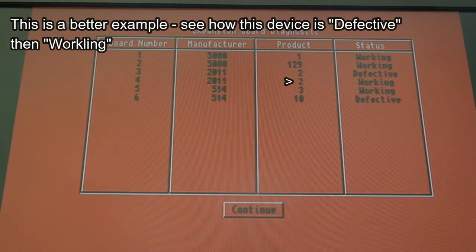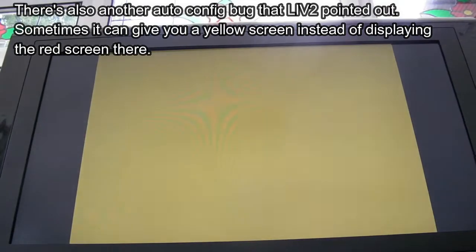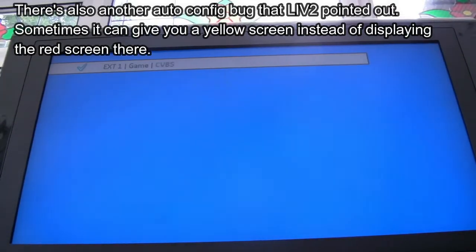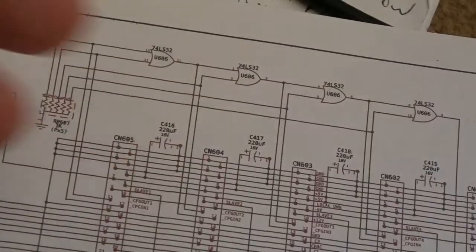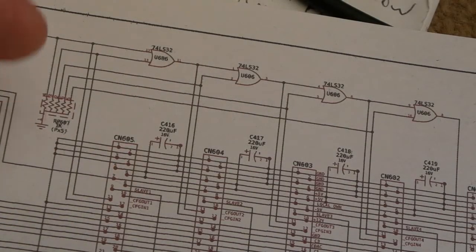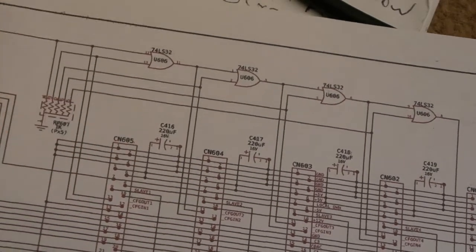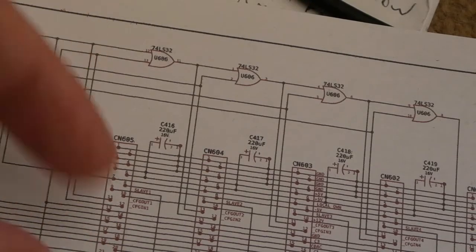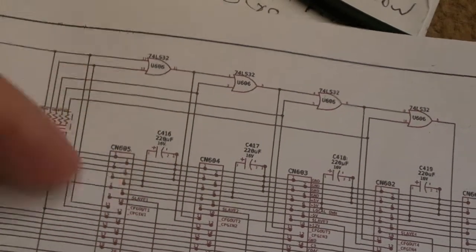With Kickstart 3.1, sometimes the order that you've got cards in these slots matters, as it goes and tries to check the size of each card and whether it can accommodate. So you've got a RAM board, one's 4 meg, and then you've got another 4 meg and another 4 meg. You can't possibly map all those in. The Zorro 2 address space can accommodate up to 8 megabytes. So the way it works is, it polls the first card and goes, what are you? I'm a memory card, I'm 4 meg. Okay, shut up. I'll explain how that works in a minute.